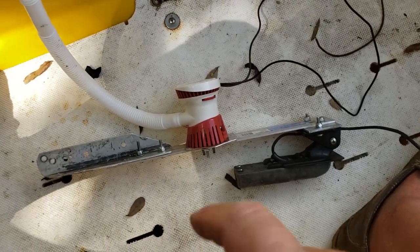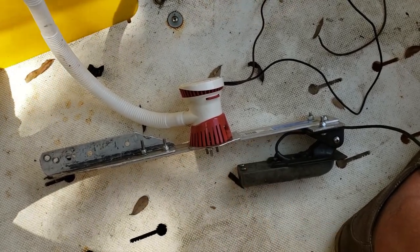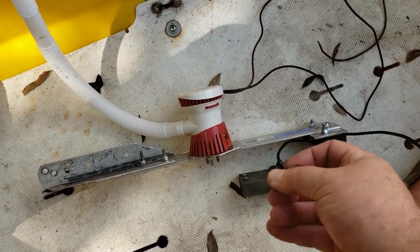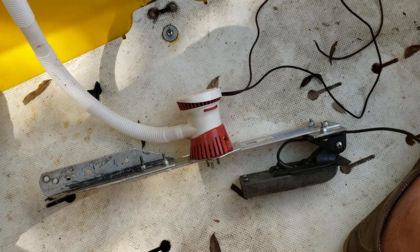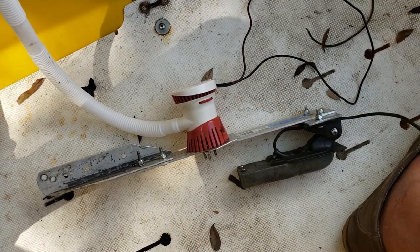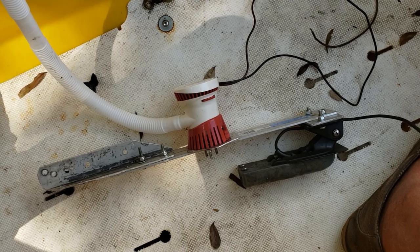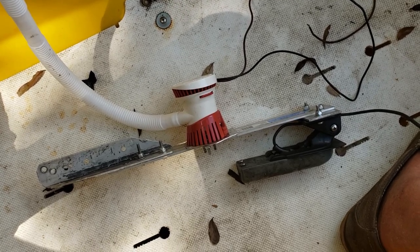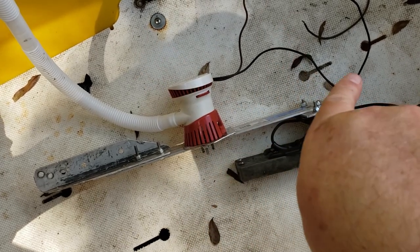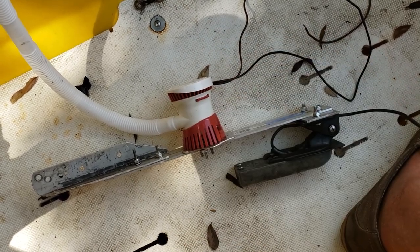I learned my lesson in the Texas 200 when a big storm hit and swamped this boat. The transducer used to be held on with plumber's putty — a kayak fisherman's trick — but somehow it got loose and migrated into the pump during that storm. All the salt water gushing in was enough to clog it, and I couldn't pump until I could get somewhere and take it all apart. This setup will greatly improve that — it's easily cleaned out, can pump as secondary to the manual, and no more plumber's putty.